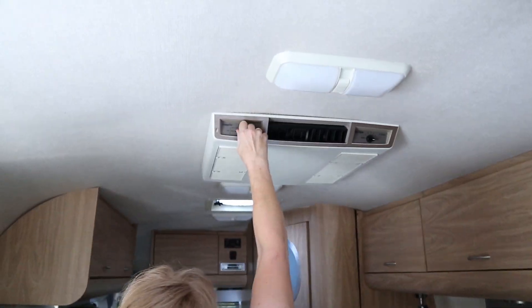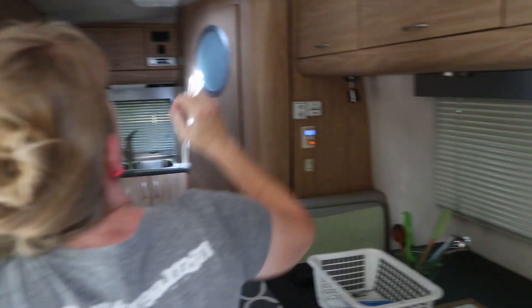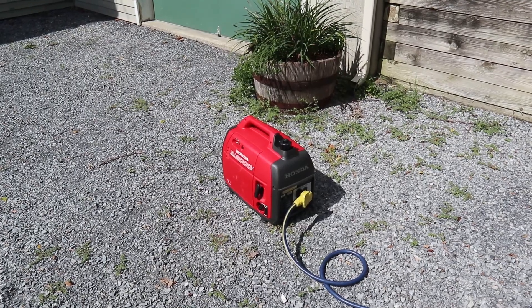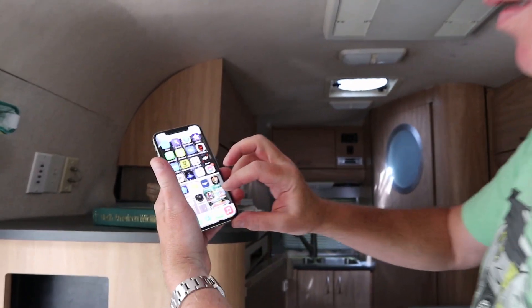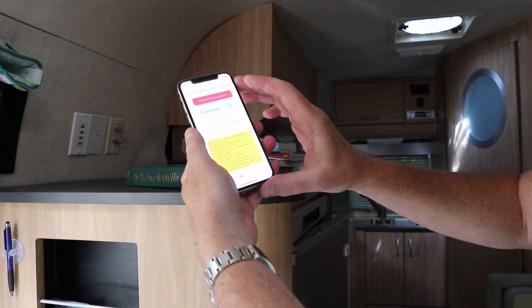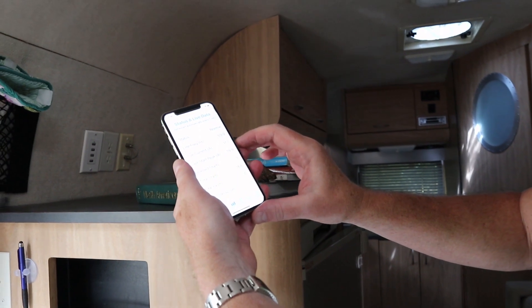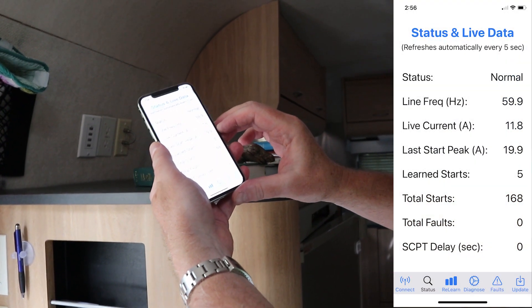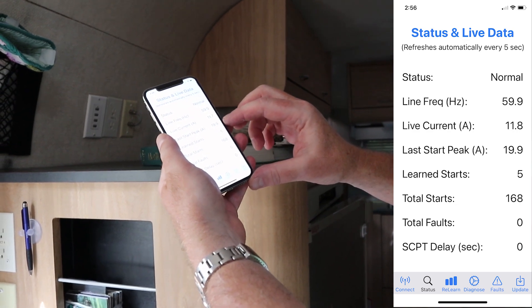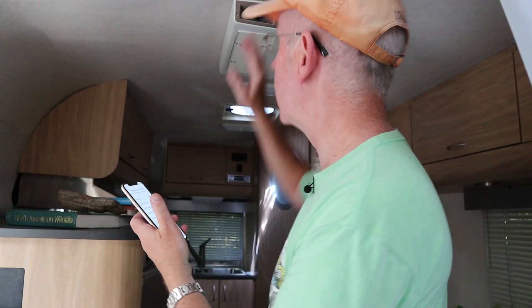Alright, here goes nothing. We didn't blow a fuse! It's sounding a little louder but that's to be expected. It's working great — we dropped from 124 to 122 volts. On my phone I have the Easy Start app. I connected to Easy Start and checked the status — the last start peak was at 19.9 amps, so it just barely got started. The current is now running at 11.6 and will usually go down. It had a little more work to do because it was 90 degrees outside, but I can actually feel it cooling. It works!